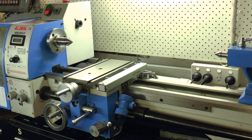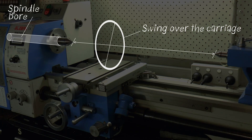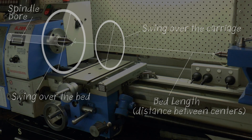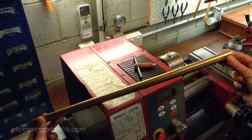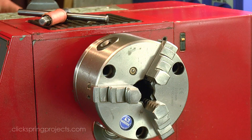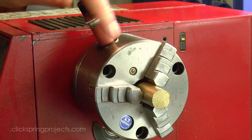There are 4 specifications on a lathe that immediately stand out as the primary limitations: the spindle bore, the swing over the carriage, the swing over the bed, and the bed length. The spindle bore is the maximum diameter of rod stock that will freely pass through the spindle. So anything with a larger diameter and you'll need to cut the stock to length with a small chucking allowance, which inevitably wastes a little material. Or if it's a long part, the limitation might mean that you need to run it out on a steady rest to put in the features, instead of being able to chuck it normally.